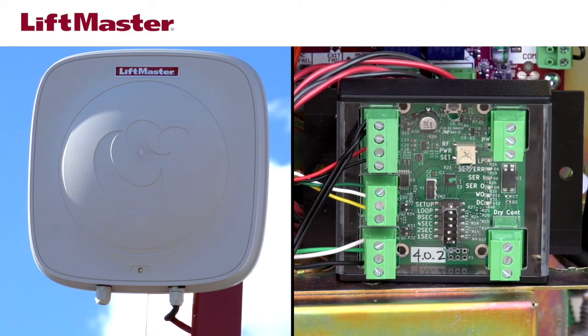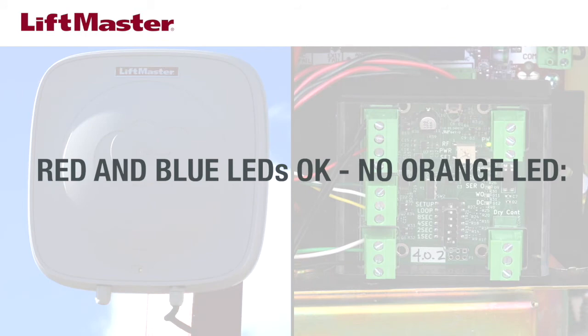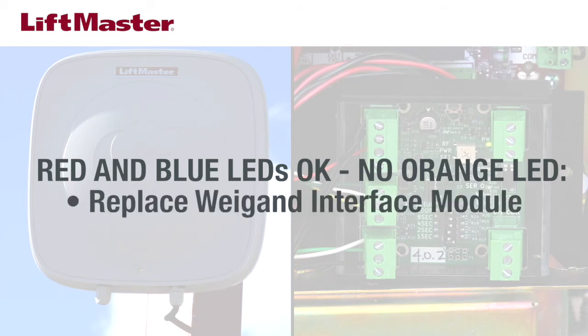If the LED on the reader does flash blue, confirm that the red LED on the Weigand module is also flashing. If it's not, double-check your wiring and make sure all connections are correct. The orange LED indicates when a Weigand pulse is sent to the access controller. If the orange LED doesn't flash, you need to replace the Weigand interface module.